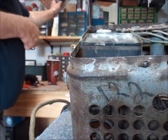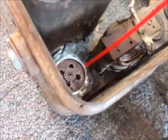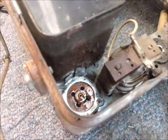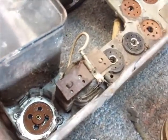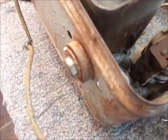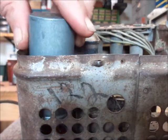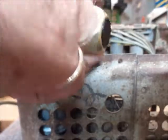You can take a little of the Deox 5 that we've been using throughout the early part of our restoration and just shoot it down inside. By the way, I do all my tube sockets this way with mineral spirits and pipe cleaners, and then I give the socket individual pins a good shot with the Deox 5. It seems to work pretty well. I'm going to try to insert this — it will be a tough fit and may take two hands, so I'll set the camera down for a second. I'll face my pins in the proper way and hopefully it will go down in.